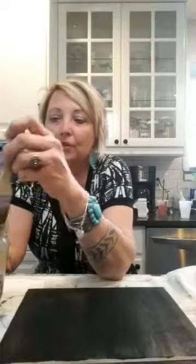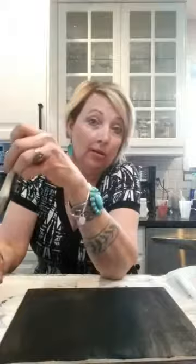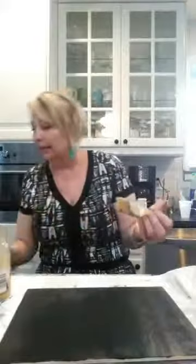So instead of using that in the house, another option is to get a can of shellac. Now, my little can of shellac is long gone because I use so much of it, because I use a lot of milk paint that now I buy it by the gallon. So I just put it in a little glass jar that I had. So now what we're going to do is put this directly on top of our dried paint, and this will act as a resist.